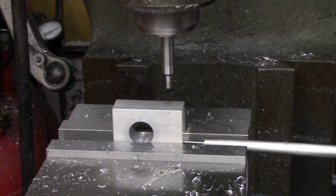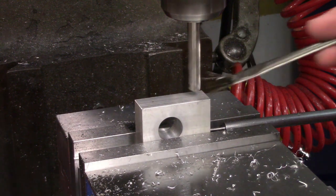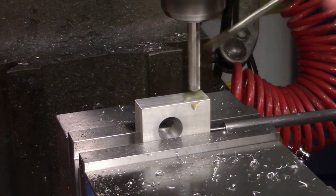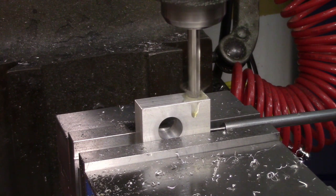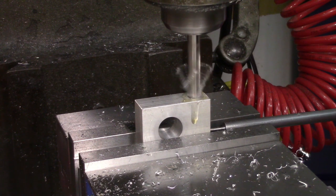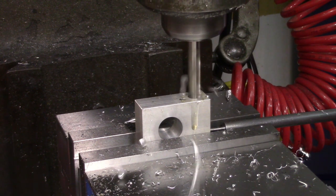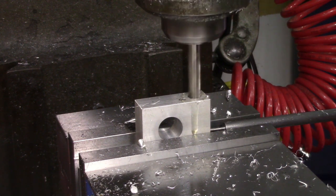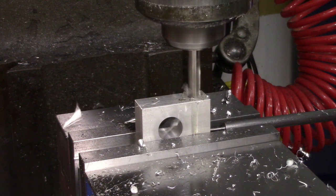Use your noggin everyone — it will save you time. Since this is just a clearance hole, I am not as concerned with accuracy here, so I'm using a screw machine length drill held in a collet and just drilling right through without spotting first. This doesn't save much time on one piece, but if you have multiple identical parts the time saved by eliminating a tool change really adds up, especially on a manual machine where you might need to move the table down or to the side to change tools.